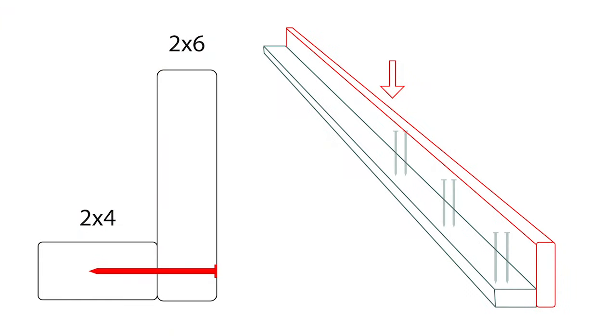Now, I mentioned strong backs and tying those into the supports to support the trusses, and this is a typical style. We're going to be using a 2x6 stood up on end, a 2x4 laying flat, nailed into that 2x6 at the bottom. We'll nail straight down through that 2x4 into the rafters. This will tie every single one together. That 2x6 is going to support the load, and it will distribute that load across all of the rafters that we're tying into the span of that 2x6.